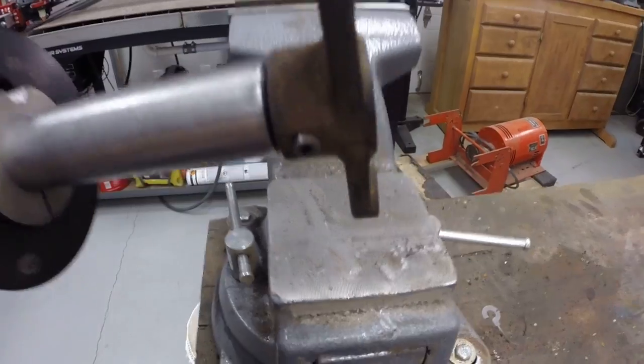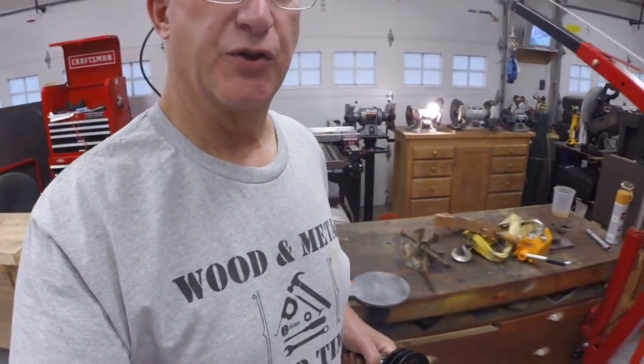And some people in their tractors will try to use bolts, like quarter inch bolts, in place of these spiral pins. It's not advisable. The spiral pins are designed to take shock loads and stay in the hole, since they are compressed when you drive them in and they spring back. So they do a better job of handling shock loads and staying in the hole.